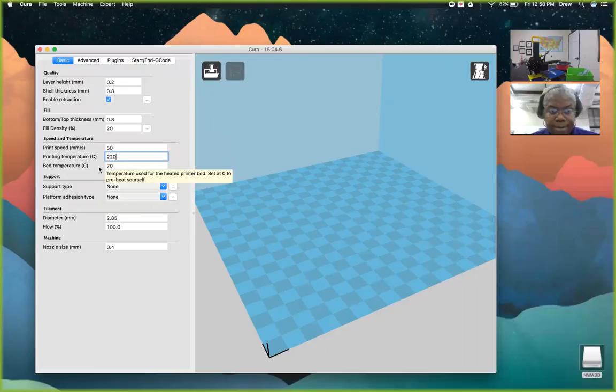Oh, that's a good question. So it defaults at a different type of material that it melts. The material that we're using that you have is called PLA, or polylactic acid, and it's biodegradable corn plastic that's totally safe for a classroom. But if it defaults at what's called ABS, which is a styrene, an oil-based plastic, that's toxic and not biodegradable. So you have to have it in a really well-ventilated area. So that's why the default is that.